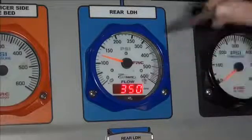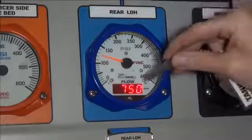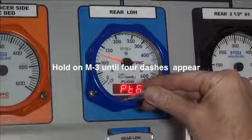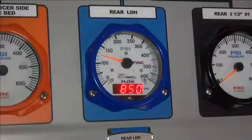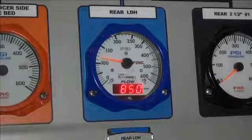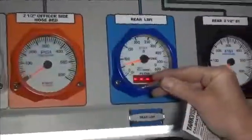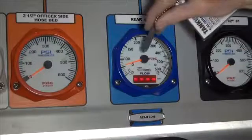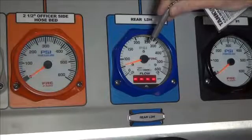In this example, we will finish the calibration process after calibrating 5 points. To complete the calibration procedure, touch and hold the magnet to the M3 sensor until the display shows 4 dashes. The program will time out after 5 seconds and return to normal operation. The calibration is now complete. Note: when putting in programming codes, there is a timeout feature that returns the program to normal operation in 5 seconds if an input is not detected.